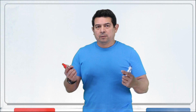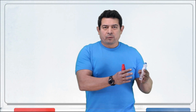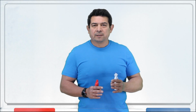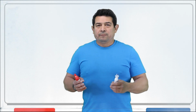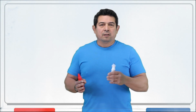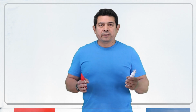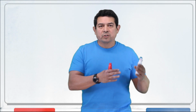Now, some people say 220, some people say 230. It's basically the same thing. When you're talking about 480, some people say 460, 480. It's basically going to be the same thing. The thing to remember is that you're going to have what they call high voltage and low voltage. The 220 or 230, whatever you want to call it, that's going to be the low voltage, three-phase. The high voltage is going to be the 480 volts. Like I said, some people say 460, others say 440, whatever. It's still three-phase, and it's going to be in the 440, 460 range.